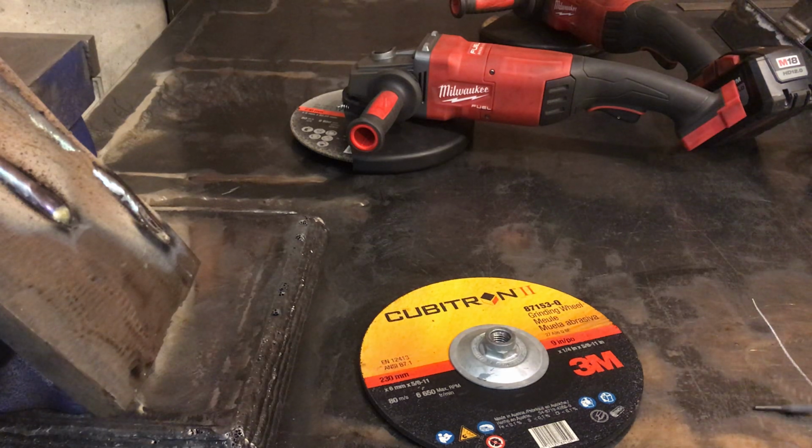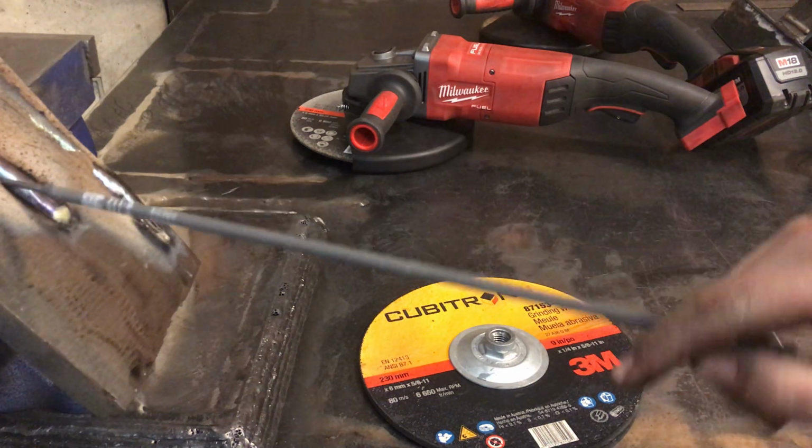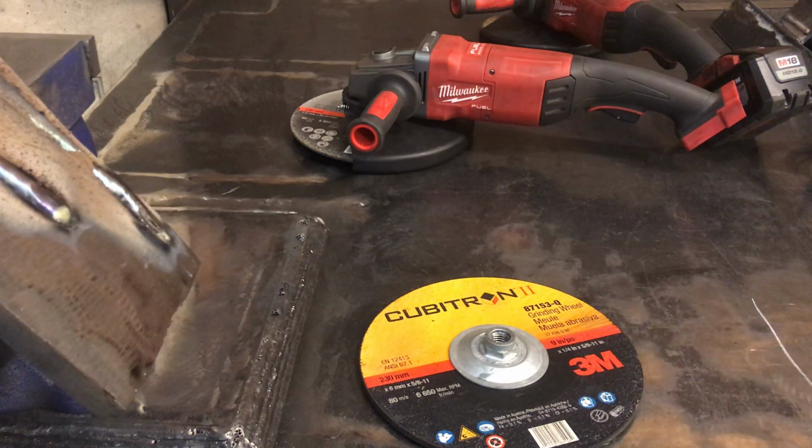And I used hard facing rod. For those who are not familiar with that, hard facing as a general rule is a surface coating that you put on a material that will have a longer wear life than the base material itself. Of course, everything is trade-offs and pros and cons. While this stuff is really super hard, it's also really super brittle, and it is not structural whatsoever. It's not something that you want to actually glue shit together with.